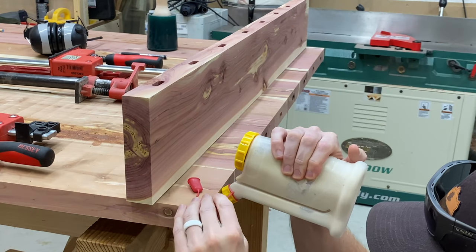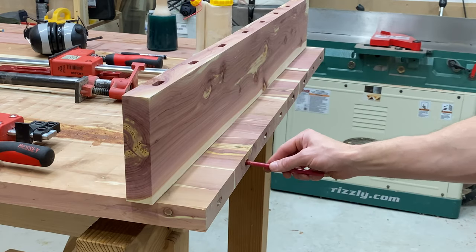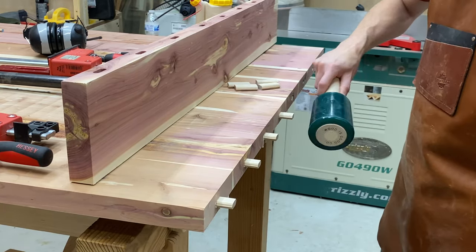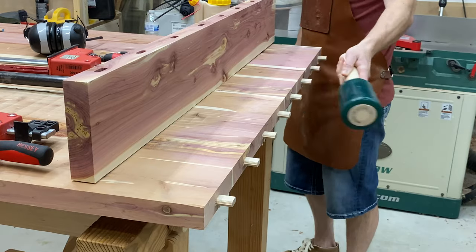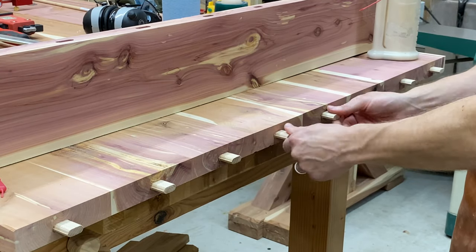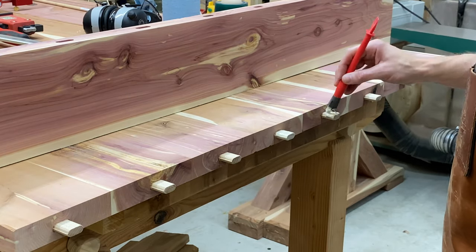All of the table side mortises receive glue. The two center mortises on the breadboard side will also receive glue and are a snug fit. Many have found it helpful to label the table side as well as the breadboard side with snug versus loose and glue versus no glue. I was a little concerned by the short dominoes, but it was either this or purchase the Domino XL, so I went with the longest I had and tested with my body weight after the fact. The point of this technique is that wood movement occurs from the inside out, so those two center mortises and dominoes will not be affected by wood movement.